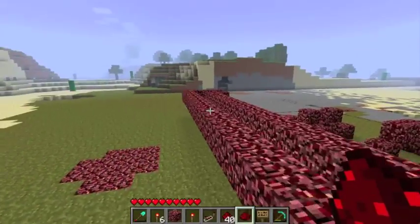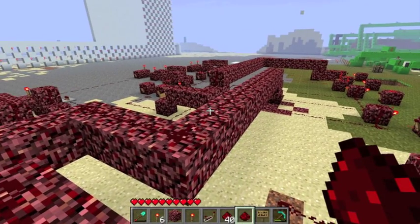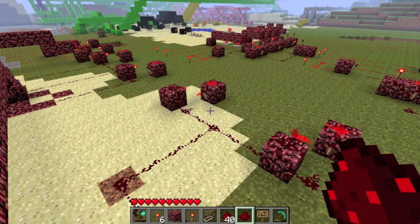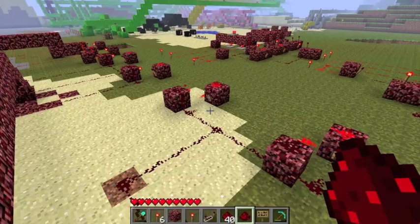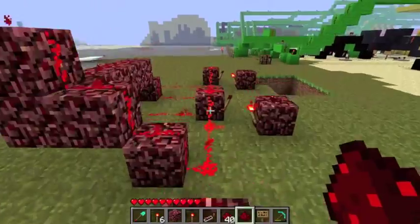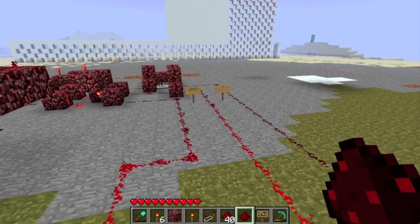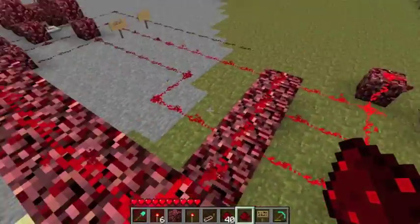Now with these — these are four, and that's the limit of our ALU. So there's really no reason that we need to route these back in, because it's already maxed out the ALU. What we're doing with these, basically, is these are just to show — like if you create a display of some kind, these will be routed out to show what's stored in your buses. But that's the only reason to do it. Basically, that's what you need to do. You make your buses and your RAM and you route it like this — two in, one from each side, into each side. Remember to keep your carry-in apart, and then the output gets routed back into the RAM. So you just create cycles.